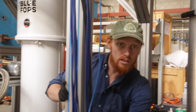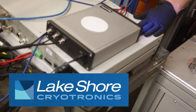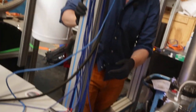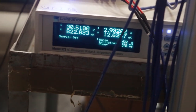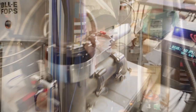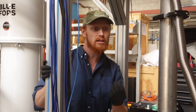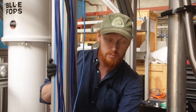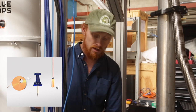One of the first parts is our electronics here. This is from a company called Lakeshore, and it is essentially a very precision electronics instrument that allows us to read out these very cold thermometers. You might not think of the thermometer as particularly complicated, but when you're trying to read out these extremely cold temperatures, it gets quite challenging to have the kind of stability in the measurement — to make the measurement without heating up the thermometer itself or causing noise and other effects. So you have special electronics as well as a special material in the thermometer itself.